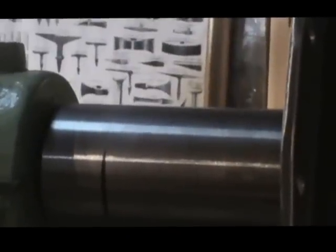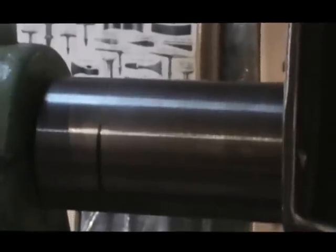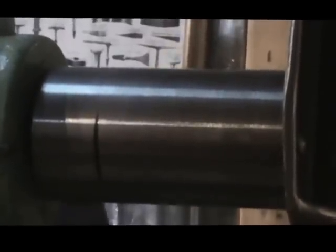And then our babbitt will be surrounding what he's grabbing right there, with another 4.5 inch pipe on the outside of that, and that's what everything will be riding on that shaft right there, and that'll be spinning constantly, running from our motor down here. There's our pulleys to the motor, and those belts will be coming up onto that 14 inch round plate that you saw earlier, which is still waiting to be built. Those are the slots that we looked at yesterday when Byron was milling those out. That's where our wood blocks will go, as you've seen in the picture, right in that area. So we are slowly coming.